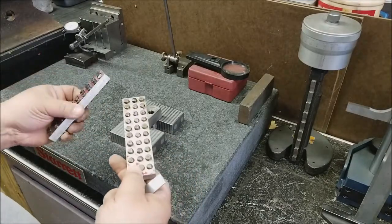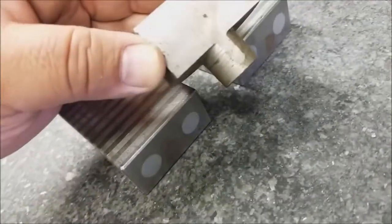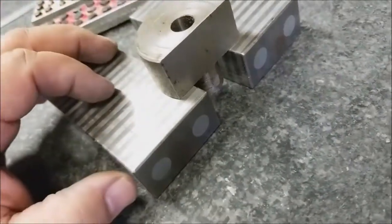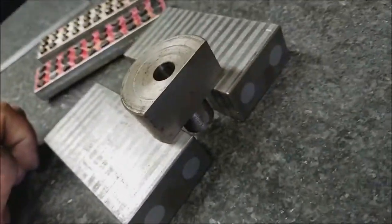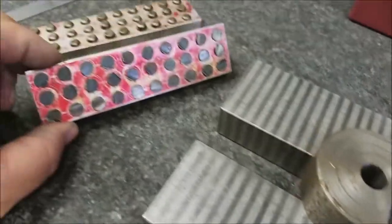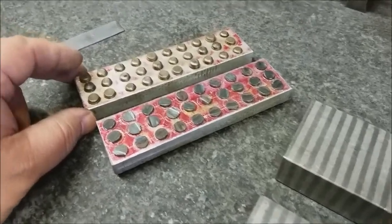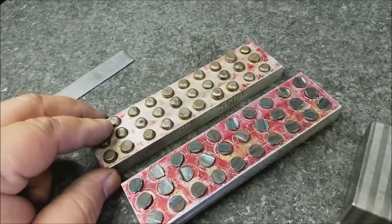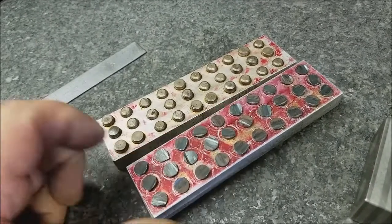That's what they're for, and I'm just going to grind these and get these out of the way — one less project lingering around from years ago. Here you can see the protrusion or emboss, and now we have sufficient clearance between the chuck — surface plate in this case — and we can grind this top surface without worrying about throwing it off the chuck. If you're interested in making some, there's not much to these. You can make these out of brass, bronze, or any type of non-ferrous, non-magnetic material along with some magnetic material.